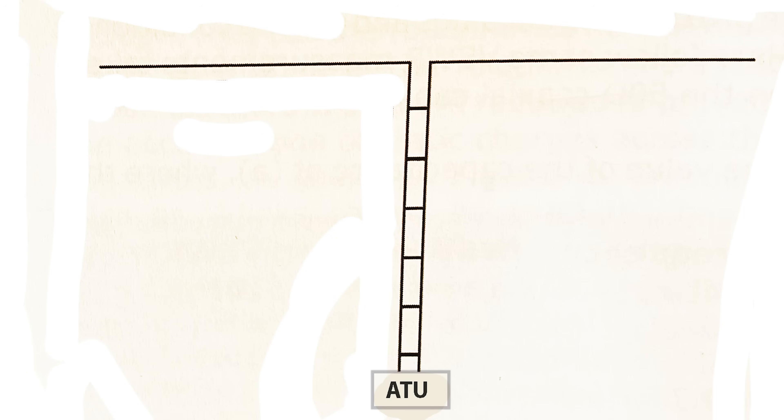If you have an antenna system - a doublet - using open wire feeder back to the transceiver, you'll almost certainly need an external antenna tuner. It is possible on some occasions to run the open wire feeder back to a 1:1 or 4:1 balun and plug it into your transceiver and hope the internal ATU will match it, but it's unlikely. So if you're going to install a doublet with open wire feeder, you will certainly need a separate external antenna tuner which can connect to balanced line - that really is an essential requirement.